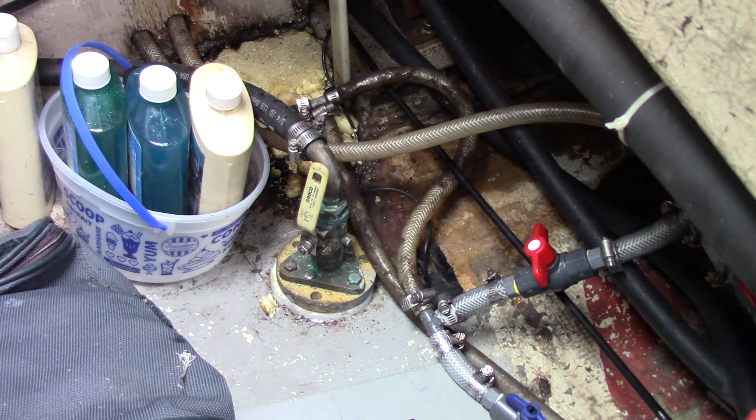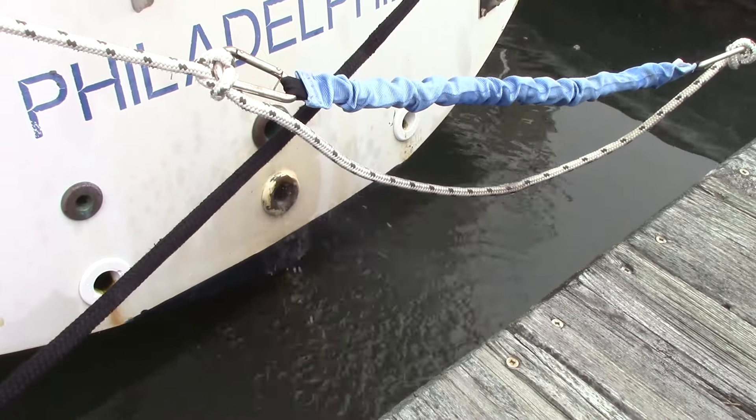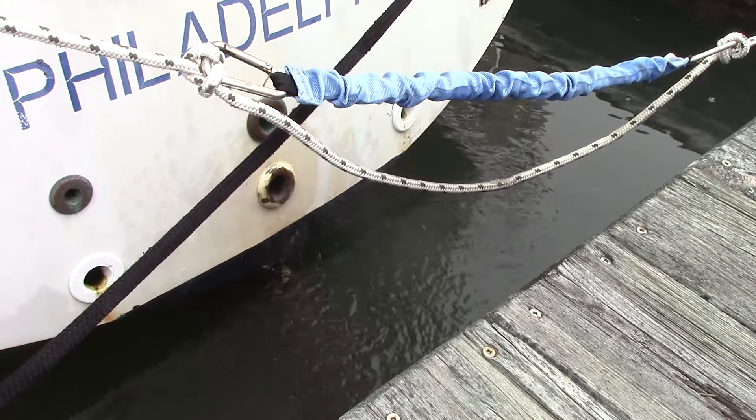You've got to heat it up before you change the oil, but all the other things look good. The belt looked tight — I'm going to run it for a little bit and check the tension on that new engine belt I put in. Boat started right up. A little bit of water coming out the back — good sign — but it's not coming out real strong. I know I just replaced the impeller on the water pump last year, but I'm thinking I'm not getting good water out of here like it should. Even when I revved it up, so I shut it down.